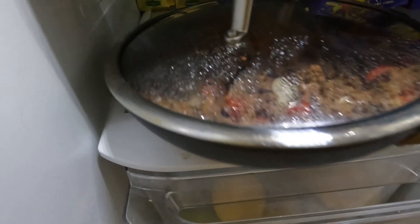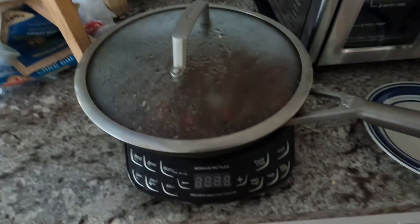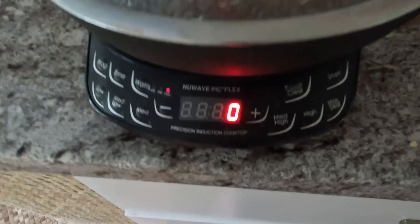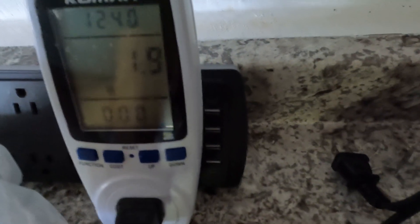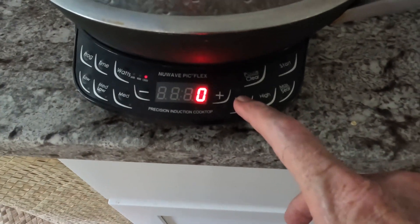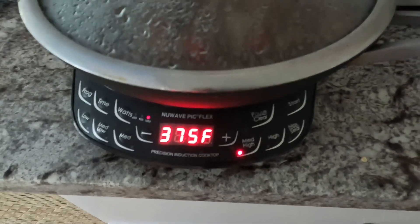In these demonstration purposes I'll show you exactly what that looks like. The system is 100% full — you can see by that little triangle the power is going down a little bit because I do have the refrigerator freezer tied into here right now, and it's a little cloudy. Let's go ahead and cook something on that hot plate. I've come into the refrigerator and I'm pulling out some leftover sloppy joes — very cold — and we're going to drop it onto this induction cooktop and heat up some lunch. The induction cooktop is plugged in and I've got it plugged into that watt meter.